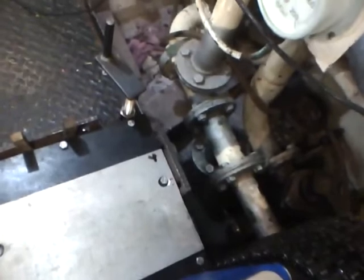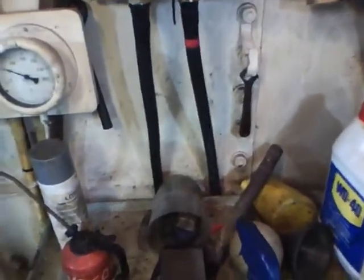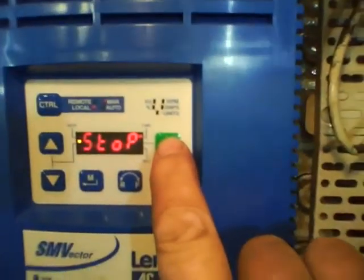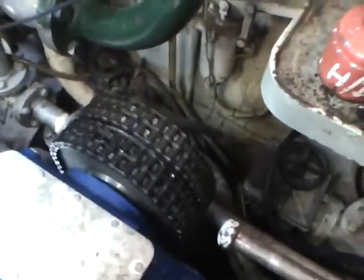So you can do all this within about five minutes of the main engine stopping. There's the main handle that I use for winding the framework up to tighten the chains. Now let's have a look at how we operate this system if we're in an emergency and we need to drive the ship. Press the start button — just winding up very slowly and steadily, turning the shaft now.